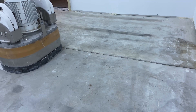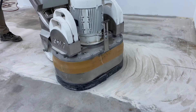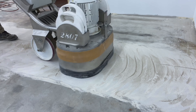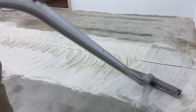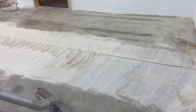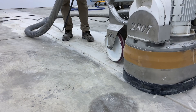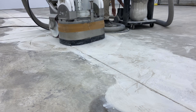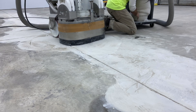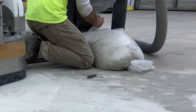This overall slab joint was approximately 40 feet long, so the majority of this process is just taking down one side of the high slab. The dust trail left behind from the grinder also gives an idea of which side is being cut more than the other — in this case, the closest side is the high slab. This is the same joint just on the other side of the building, where the right-hand side is high and the left is low.